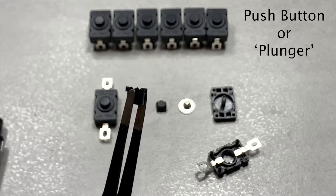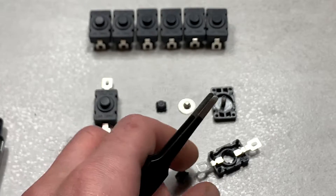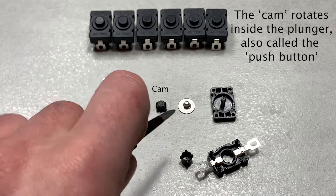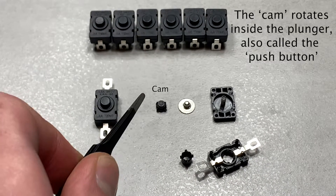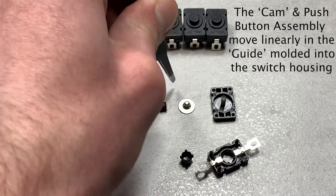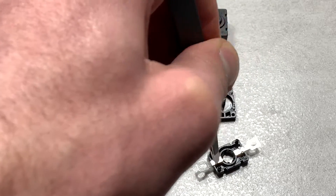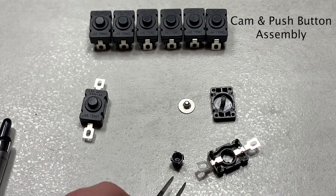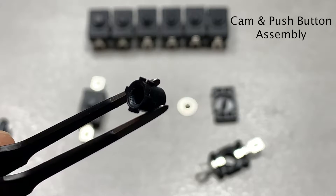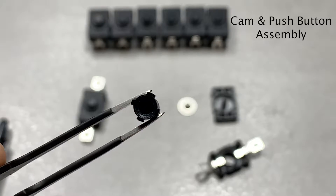It's the jagged-type plastic piece, where that top piece fits in, and then when you push it down, that piece rotates and locks in a certain position — either up or down. And depending on whether it's up or down, this contact piece will make or break a contact between these two pins. I've put the two together into the button, and it's that piece that rotates and locks.